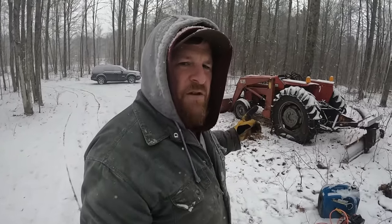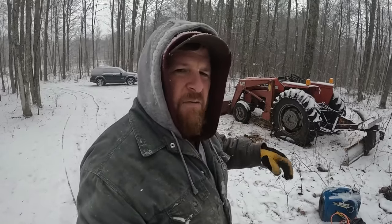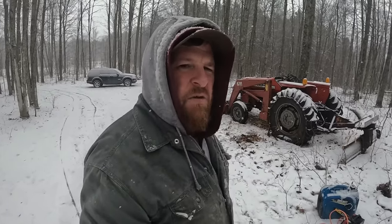Do these old tractors, I know a lot of them used to have the dual batteries that are run in series, so you get your 12 volts that way. Like the old tractors, like this one. You go to Tractor Supply or any of the stores, they have them long 6-volt batteries. And then you could put them in series, I assume. And do those have more cold cranking amps? Or more cranking amps in general?